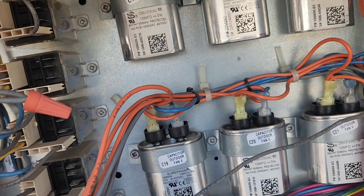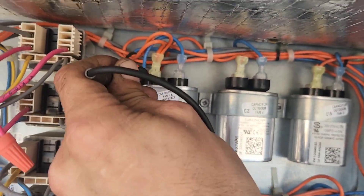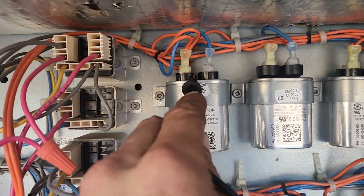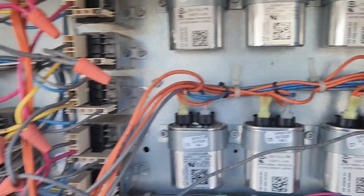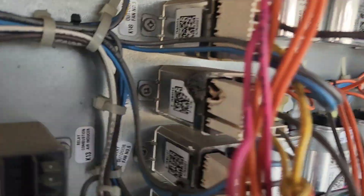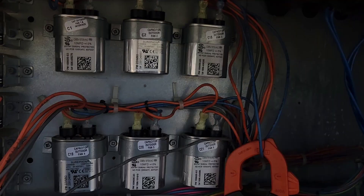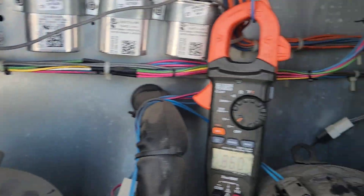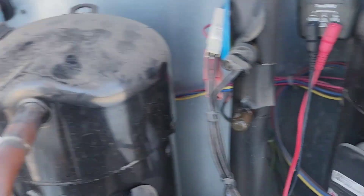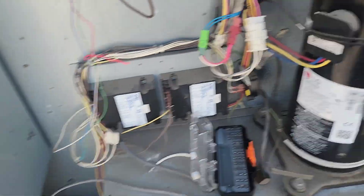I tested my meter circuit by circuit — from gray to orange on fan motor one, gray on fan motor two — I got voltage on all of them, 478 volts, except on the one with the stuck relay where something funny is going on. I need to replace that relay and then hopefully the motor will come back to life. So the parts list: six capacitors, one relay, at least two motors — maybe three, I'm going to request approval for two — and an A91 humidity controller.